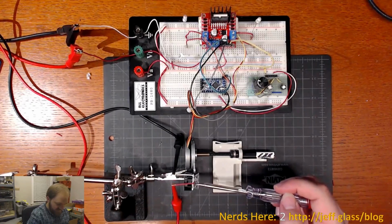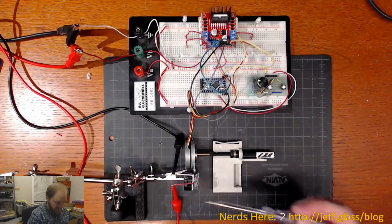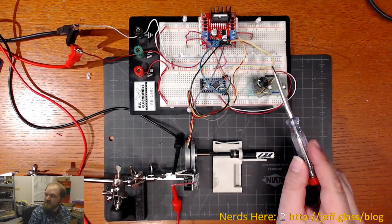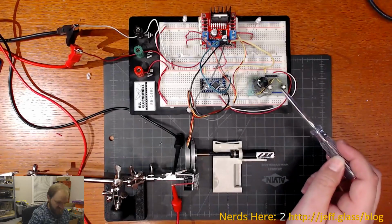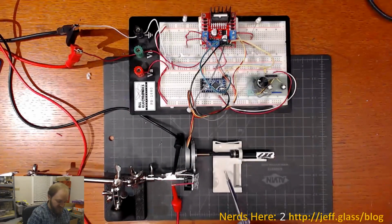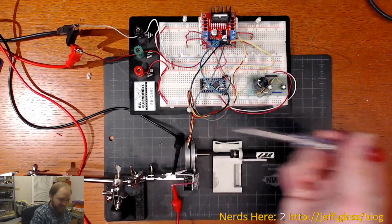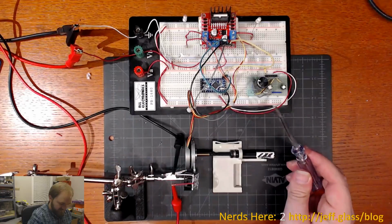So this here is a 3-up emitter. That's one of those same 1,000 lumen emitters from Carclo, and that has this narrow spot lens in the front, which we're going to start with experimenting with. This whole setup here is a stepper motor arrangement that's hooked to an Arduino Pro Mini and this little control board. And then this is just a stepper motor that we're going to use in this sliding platform. We're going to mount some lenses to this and use this as a way to shift our lenses back and forth, and we'll see what that does to our optics.